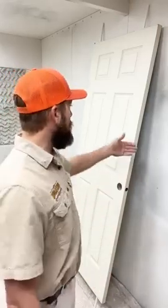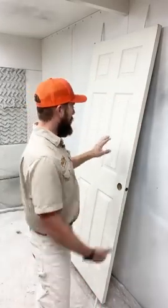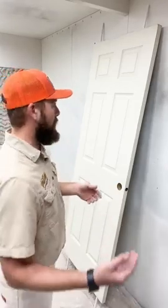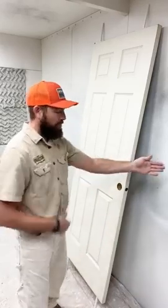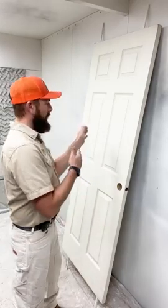So what we do is we swing the door in, and the door has basically 6 sides. You got a top and a bottom. When a door is hung, we're not going to mess with those. Those are normally sealed at new construction. We have the 2 big slab sides and the 2 jamb and strike sides like this. If you do doors right, and there's a right and a wrong way to do it, one of these sides will be the outdoor color, one of these sides will be the indoor color. So if a door is going to swing inwards like this, you would take the strike side like this, because this is the side that you're going to see. The jamb side, when the door moves like this, the jamb side's facing outside.